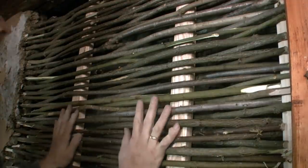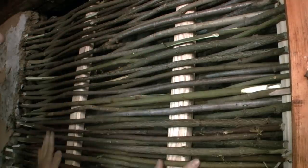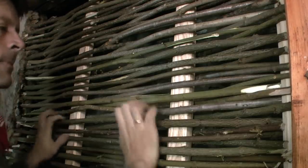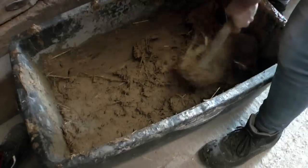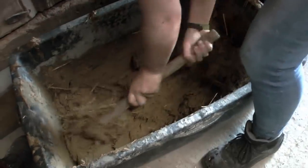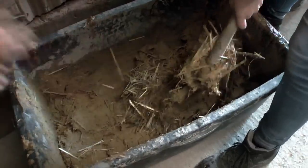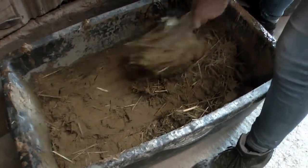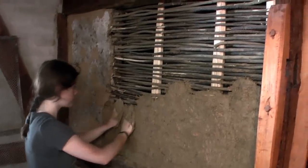In the end, an amazingly tough and resilient wall was created. It became clear to me again that this type of wall filling is really not a makeshift measure, but a process that had been perfected over the centuries and optimally adapted to the timber framework. Now clay with straw had to be put onto the wattle — this time no longer with historical material, as I had run out of it, but with fresh clay from an embankment on a building site, collected nicely crumbled by the winter frost. Straw, already chopped up, can be found abundantly on fields at harvest time where combine harvesters lose it.